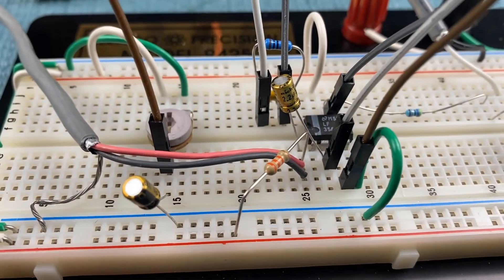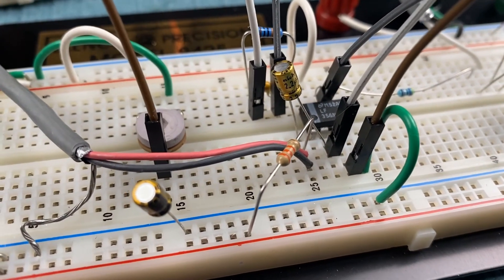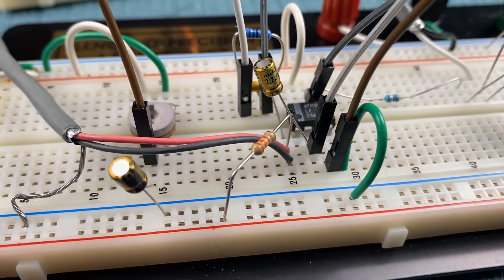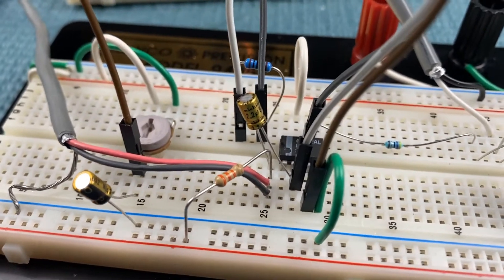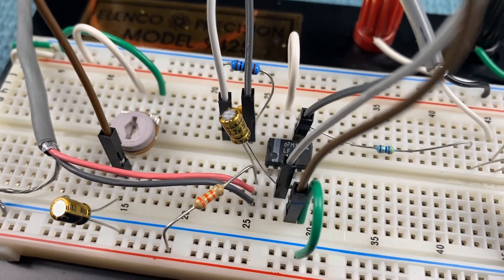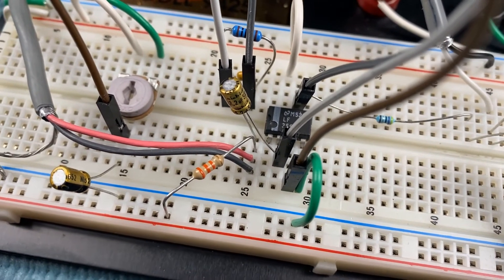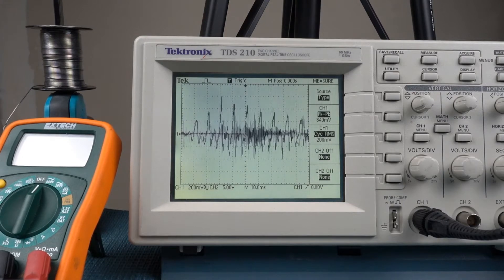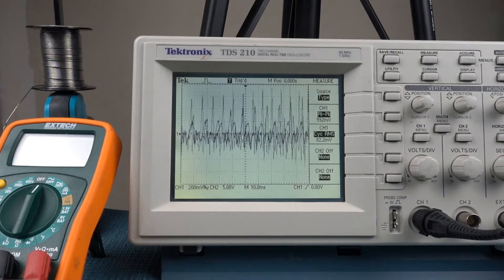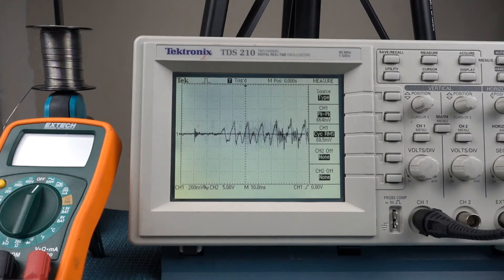I'm a little disappointed that there's audible noise. I measured that the open mic noise floor is minus 26 dB. The voltages around C3 weren't correct as the mic is not the same as what's referenced in the article. I replaced R1 from a 14 kohm resistor to a 33 kohm. The noise dropped an additional 6 dB and followed 6 dB less gain of the circuit. For reference, there's no compression, equalization, or noise reduction added to the electret mic audio.